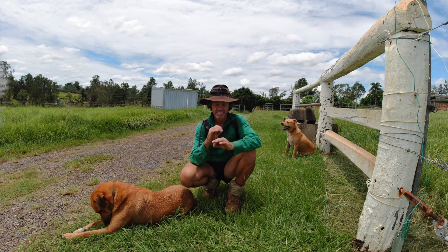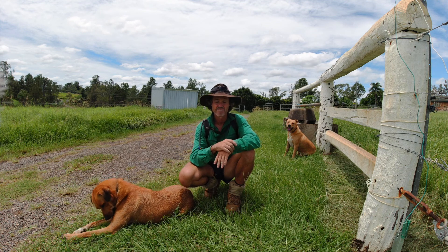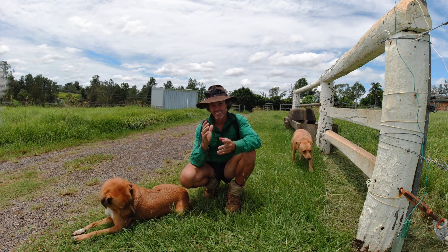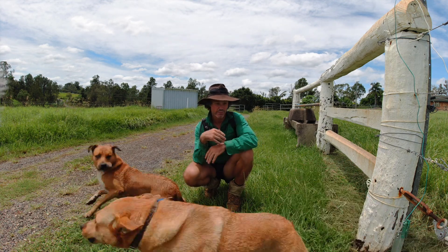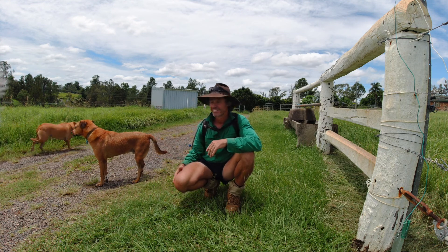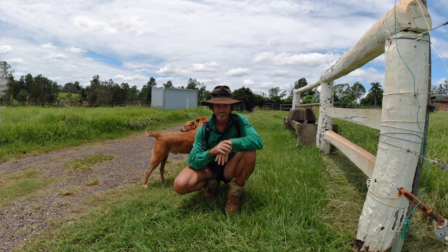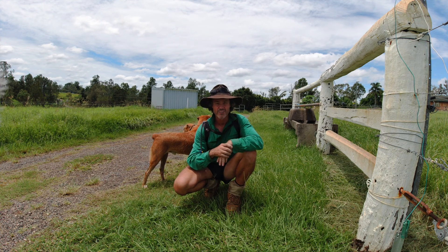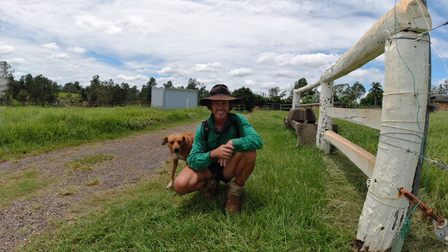When it's in a clean state it's just maintaining voltage; unless something completes that circuit, you're not using power at all. So it is a very low-cost fencing, but when you get vegetation against it or animals or people touch it, that's when it actually starts using power. As you can see, that is very hot — I forgot to turn that off. Dogs very rarely go near it. Hope you have a terrific morning, a great afternoon and an awesome evening, and I will catch you later.